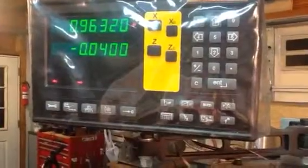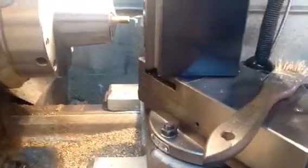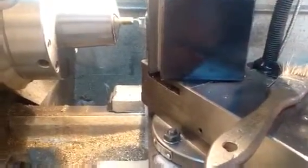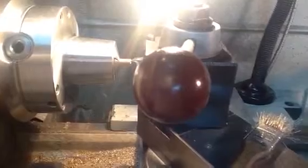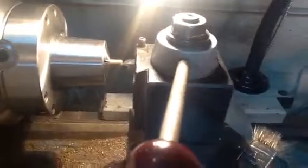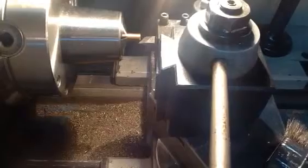And I've been making these 40 thousandths of an inch deep as well. So you can see this is the last cut. I just wanted to show you. It's kind of like a shaper or a slotter. I'm turning the handle of the lathe, and let's see if you can see this. I'm just taking off about 2 thousandths of an inch. As I crank the cutter towards, you can see a little bit of brass fuzz on there, and that's all there is to it. I'll back this out, show you the completed slot.